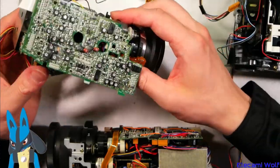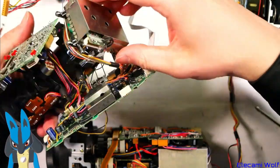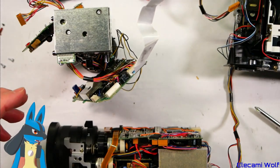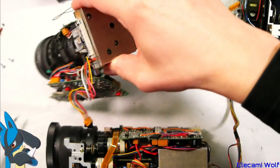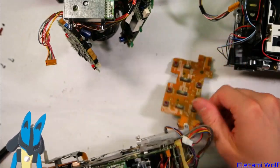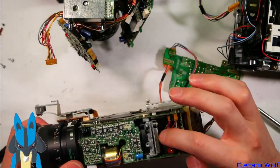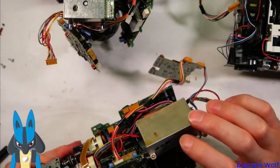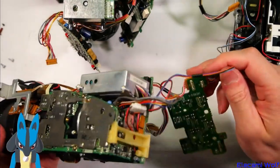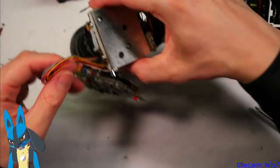So this is pretty different — it's got two main boards and then one back piece in a shielded enclosure for the CCD and related bits. Whereas the older M5 has plenty of boards — these two big ones, plus another one there, and another one there, and then the CCD stuff in a metal box, and then another board. So they've really miniaturized and integrated things in this model. That's pretty interesting — it has advanced a fair bit. Probably more than what it did between the M1 and M3, because that was just adding autofocus and a couple of other little bits and pieces, not as major a change in the whole design.